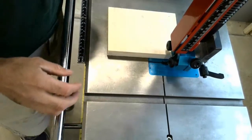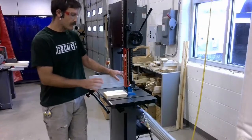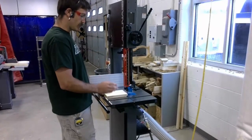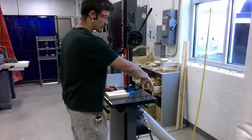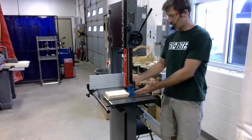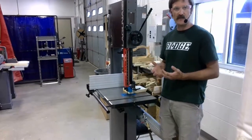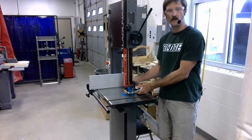Both of these push sticks hang on magnets on the front of the machine so that they are always there and available for you. As the operator, you are often going to be standing directly in front of this machine making your cuts. There may be a situation where it would be nice to grab your workpiece from the back — you can either reach around and pull your workpiece through, or you can come to the back side of the machine and pull your piece through to complete your cut. This is rare, but it is a safe way to complete a cut because your hands are behind the blade and you can't possibly slip into the sharp side of the blade.